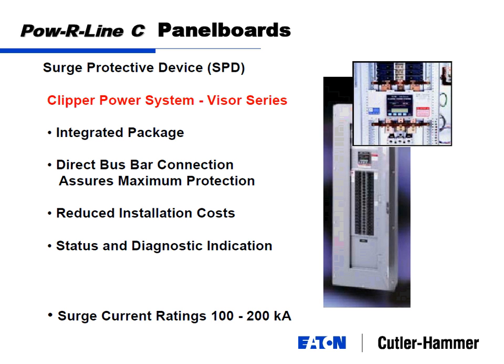Likewise, inside your facility, your fax machine, your copier, your ballasts, those are all throwing the jabs. Transient voltage, transient voltage, transient voltage. And after it hits you 10,000 times, eventually you're just going to wobble over and fall down. And that's when your computer fails after a year and a half instead of the 3 years you're hoping for. So these are two ways transient voltages can damage your equipment, and both are protected by an SPD device.